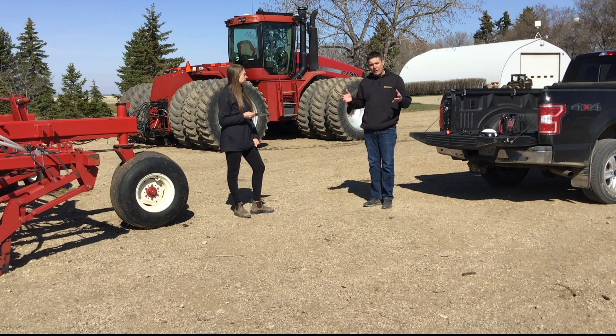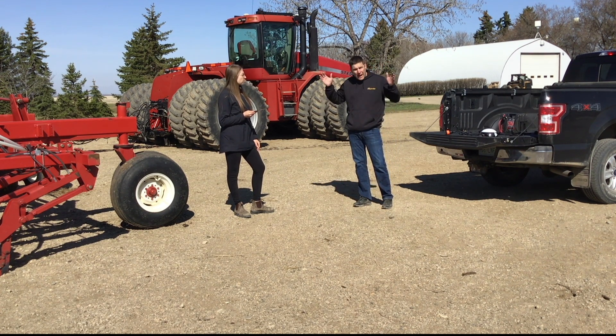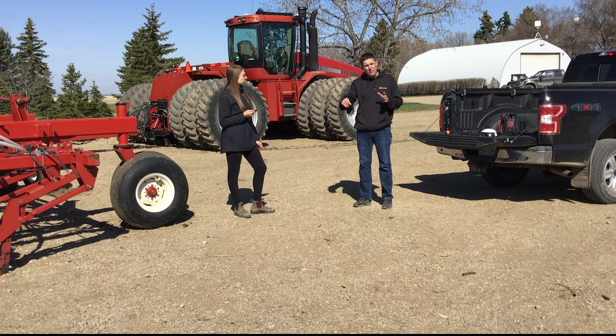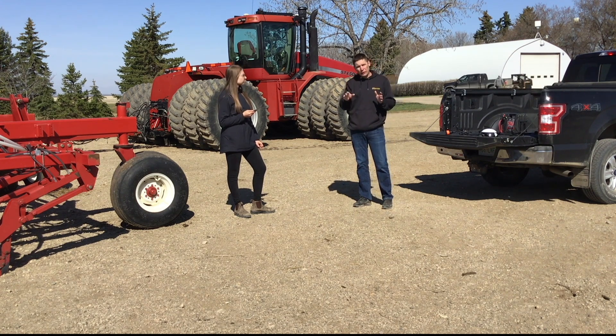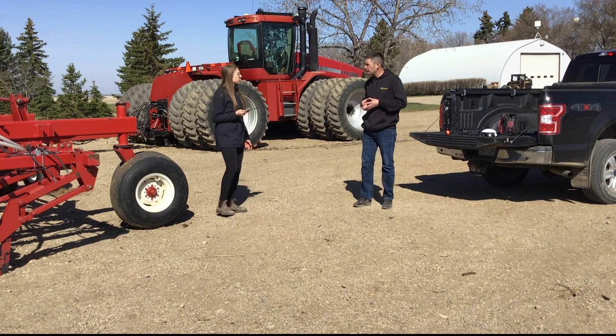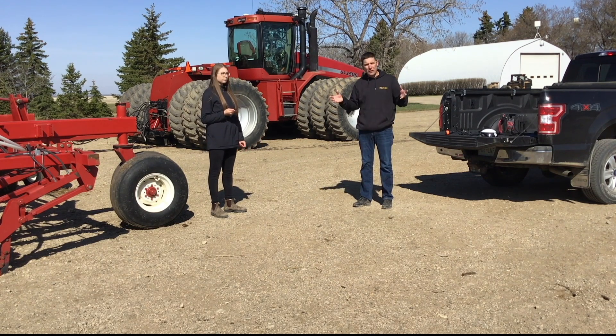A trick: if you seed, spray, or plant your headlands first, you don't have to tap to start and stop every single time you're turning around the field — FieldView will recognize that you've already seeded or sprayed those areas. This process is very similar to how you'd set it up for a sprayer. Set up a new sprayer, make sure your distances and widths are accurate, and set it to incompatible rate controller. Once you're connected to the drive it'll all be green, and at the bottom it'll say 'Tap to Start / Tap to Stop' — you only see that when you're set up for incompatible. If we're collecting data from the rate controller directly, it'll automatically map. If you have questions about whether your GPS is compatible with FieldView, get in touch with our support team or activation specialists. Hope this helps — thanks a lot!